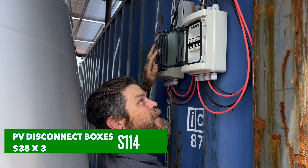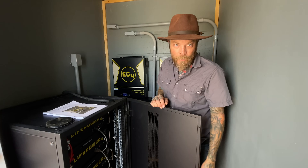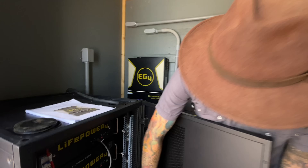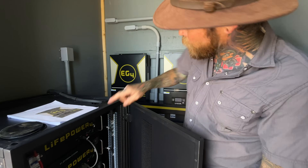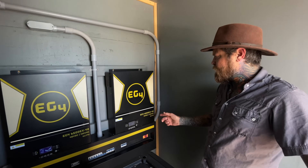This is our server battery rack — a 48-volt battery system that charges up to about 54–55 volts, rated at 100 amp hours at that voltage. Total, this is about 30 kilowatt hours of power — a massive amount of juice. You can see from the indicator lights it's already fully charged with less than an hour of sun today. The system uses COM cables so the batteries self-balance each other and communicate with the main inverter to prevent overcharging.